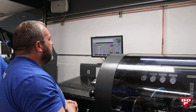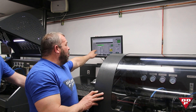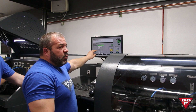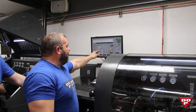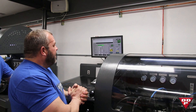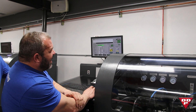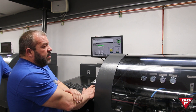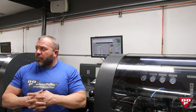So that injector pumped. The min/max for the set point would be 127.9 plus or minus 5.5. So essentially using the factory test plan, 127.9 is in the middle of perfect. Plus 5.5 is our maximum, and subtracting 5.5, we can basically go from about 133 down to 122 — 121.5 — and that's good. We're reading 131 with a return of 17-18. The factory's test plan is going to allow like 50 mm cubed for return and it's still good.